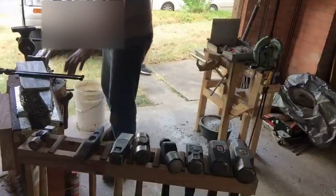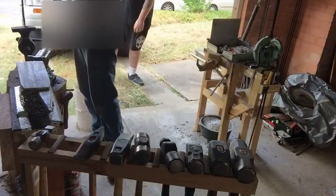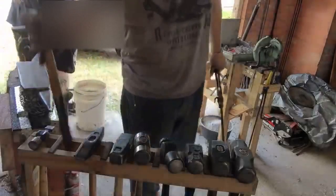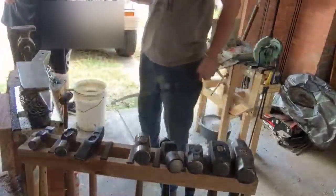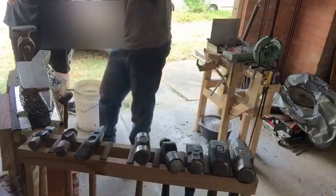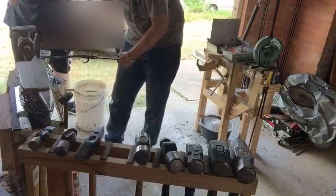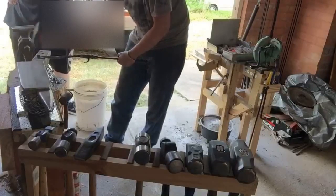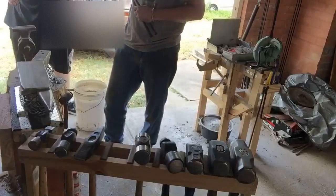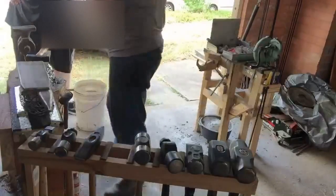Okay. The con is yours. Ooh. So what you want to do, technique-wise, switch you back to big orange. You want to lay it spine down, and you want to whale it diagonally like that. Yep. And basically just keep hitting dead center until it's flat. Only do it while it is close to yellow. If it starts getting too close to red, it's just going to weaken it and you'll end up with more cracks.